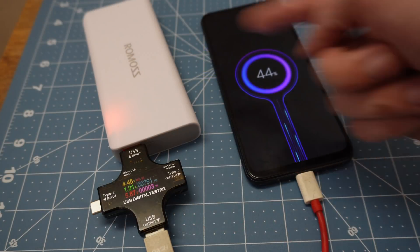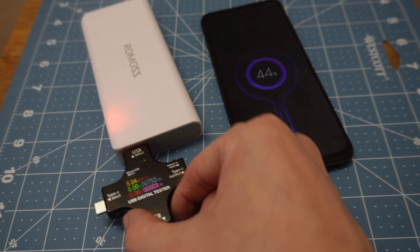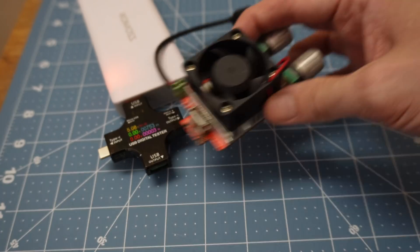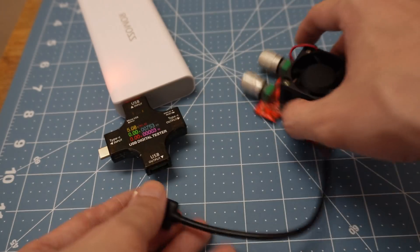The power bank itself is so hot that you can barely touch it in this area. My concern is this is going to damage my cell phone — it keeps turning on and off. So what we'll do is disconnect the cell phone and put this dummy load in its place. This dummy load will basically draw the same amount of power as the cell phone, but we don't have to worry about it getting broken.